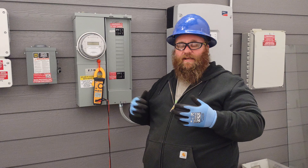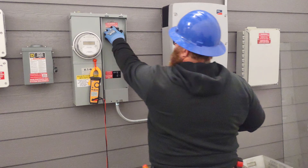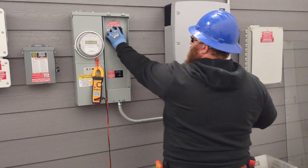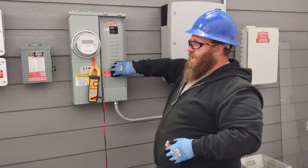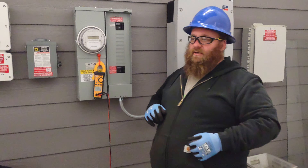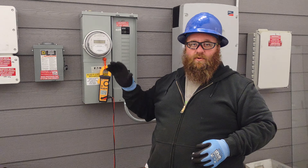Then we proceed with activation. At 240 up to 700 volts, we want to maintain a three-foot clearance of anybody around us — I usually prefer five to six feet — and push everybody away. One hand on the breaker, turn our head away, and fire it up. Same thing when firing up the solar breaker — it's still a 220 breaker — turn your head away and turn it on. Then we can look at the screen to verify lights came on. We can verify flow on both sides on the screen and check downstream items for voltage if needed. As always, guys — like, share, and have a great day.